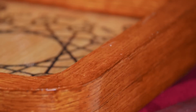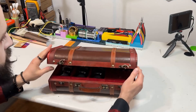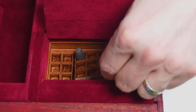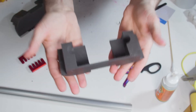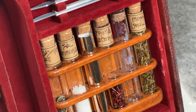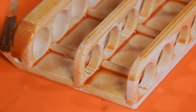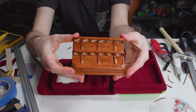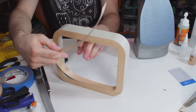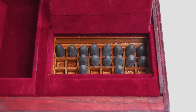From Zach Friedman, we have an outstanding collection of tips to make your 3D prints not look like 3D prints. He's made this cosplay prop of an antique portable alchemy case, and it's almost entirely 3D printed. The base is made from foaming lightweight PLA and then coated in velvet. This vial rack is printed in wood fill filament and covered in layers of stain and varnish until it takes on a convincing look. This wooden tray is also 3D printed, but instead of using wood filament, he's applied a layer of wooden edge banding to sell the illusion. Tons of great stuff in here.